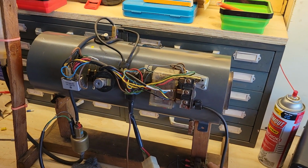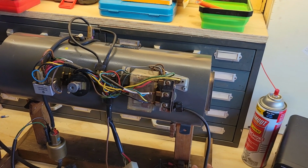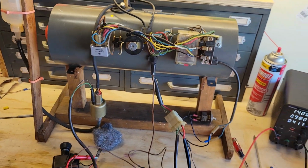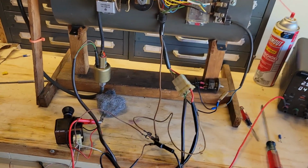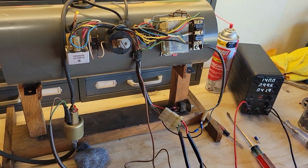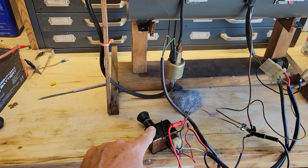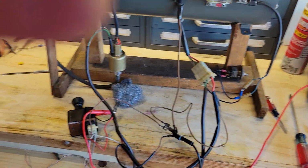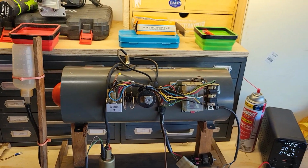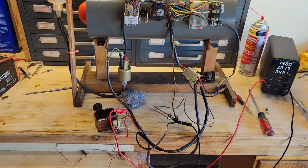And let's say the thermostat again reaches optimal temperature. The thermostat knows it, and it'll click off the fuel pump. Except this time, we don't want it to keep going, so we turn off the switch as well. So now the switch is off, the main switch. This will just cool down and shut off all on its own at this point.